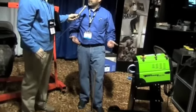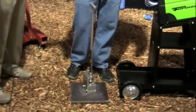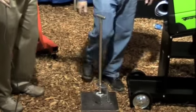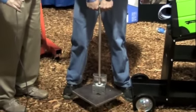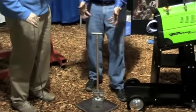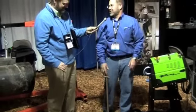You can pick up something with a thousand pounds here — let's take a look. This is one of our more popular items, also sold for the infrastructure community — guys who are lifting valve boxes out of the ground, lifting heavy plate steel coming on pallets, or just cleaning up debris around their machinery. We simply took a couple different sizes of our magnets and put them on a stick. In this case it's about an 1,100-pound breakaway magnet. You put it in place on your piece of metal, turn it on. Even if it's a two-handed job, it's not going to break away — you have a secure way of holding it. Instead of bending down and trying to get your fingers underneath these pieces of metal, I'll just turn the magnet on and lift it up by myself. Much easier, much safer.